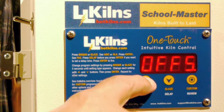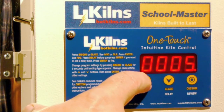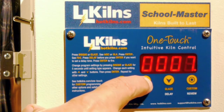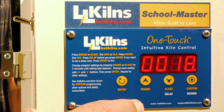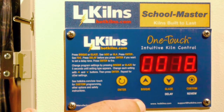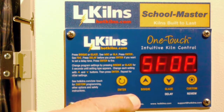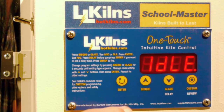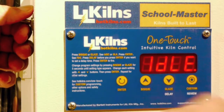If I hit the up button, I will be in the positive range — this is thermocouple offset. What it means is: if I put in, say, positive 18 degrees, that's telling the controller to add another 18 degrees Fahrenheit or centigrade to the signal. I'm going to leave that in there and hit Enter. You notice that the ambient temperature has changed because it's in degrees centigrade, and you see the little red dot.